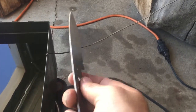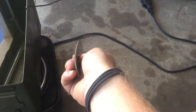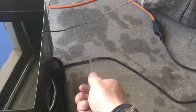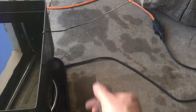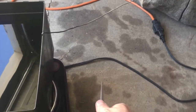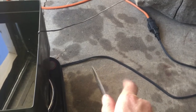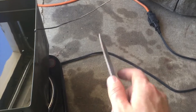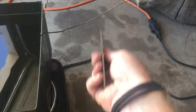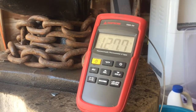Going into the quench, you want your knife to be flat — plunge it in straight down like this. Go straight in and then agitate immediately. Just do a gentle up and down, not side to side. Don't swirl, just go up and down. Swirling will cause the sides to quench at different rates, which causes warping. So just go straight down, up and down. Alright, I'm just about there — I'm going to fire the forge up and do a quench.